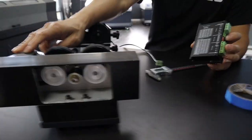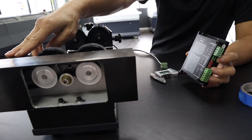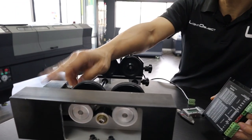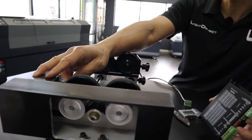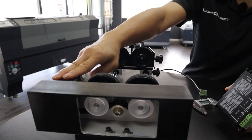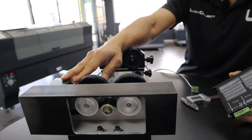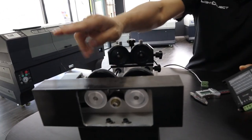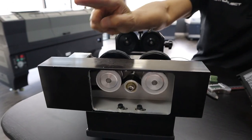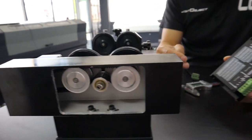For the current setting, for most small motors like the rotary, you can set the current up to 3.2 or 3.5 — it doesn't matter as long as the motor doesn't feel very hot. The way to test it: set up the rotary, power it on, let it idle for maybe 20 to 30 minutes, then touch it. If you can hold on for more than 8 to 10 seconds, it's pretty safe. But if you can't hold it for more than two seconds, the motor is over-current and you need to tune down the current.